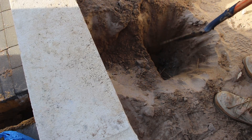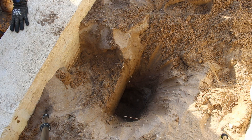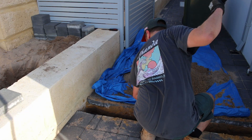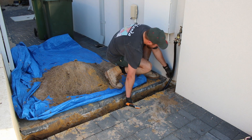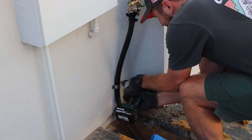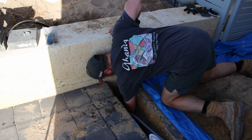I also dug a hole below the retaining blocks, which was a bit of a mission — there was a second row of retaining block inside the garden making it trickier. But we got there and I could push through some 25mm conduit. This stuff is easy to cut with a box cutter — just make sure you use gloves. Then I wiggled it onto the barb fitting. To keep things tidy I installed some wall plugs and used a 25mm half saddle to fix the retic pipe to the wall.